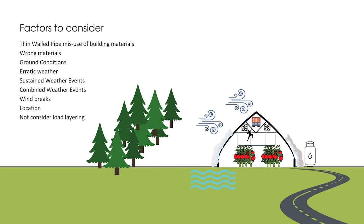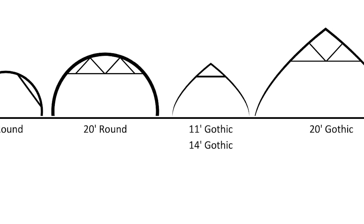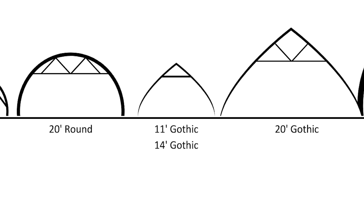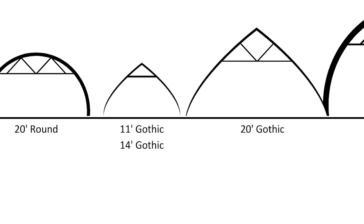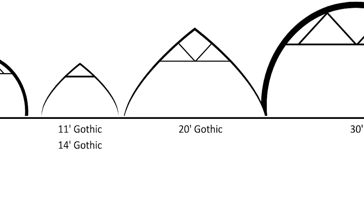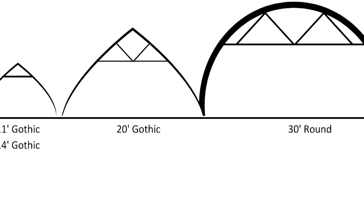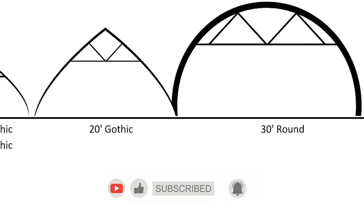Consider load layering — everything added up. You have live loads, dead loads, wind loads, and snow loads, and oftentimes they all combine. If you think you're going to cheap out and then start adding layers, it may come back to bite you. High tunnels can straight up take a beating — when that plastic is on tight, everything's battened down, doors are secure, and louvers are secure, that wind is going to hit and go right around. With proper bracing and planning, there's not a greater investment you can make for your farm than hoop house production. The crops are better, you have more control, and despite all the considerations, these things are pretty strong. Take these considerations and plug them into your planning or upgrade process — I hope this is helpful, and we'll see you next week.